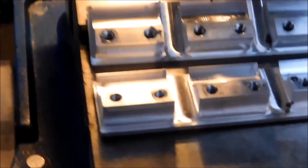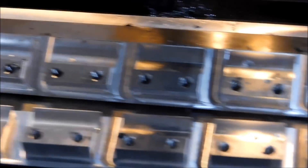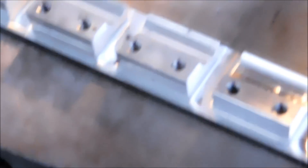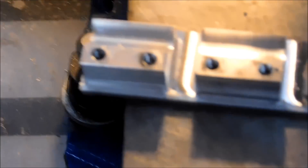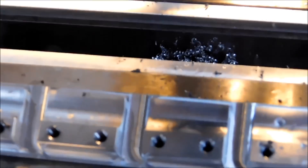Now I have a bunch more of these holes to do, but I figured I would just show you the concept, because that sliding rail concept works very well. Please do not hold these by hand when you're running a tapping head down into a part. If the tap grabs, you're going to have a helicopter and a meat slicer, and I guarantee you're not going to get your fingers out of the way in time. So if you can keep your part from spinning and from lifting, it can float in the setup, and the setup will work just fine.